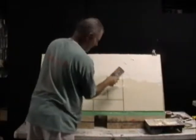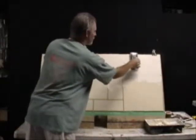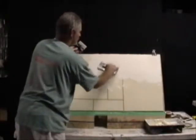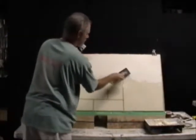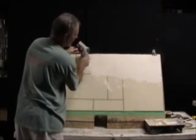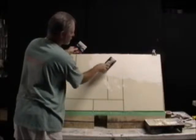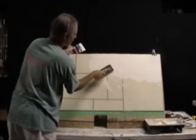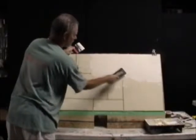Alternatively, you can use the magic trowel. If your angle is too steep, you will get a chatter or scrape too much of the material off. So it's important to use just a very shallow angle for this technique.